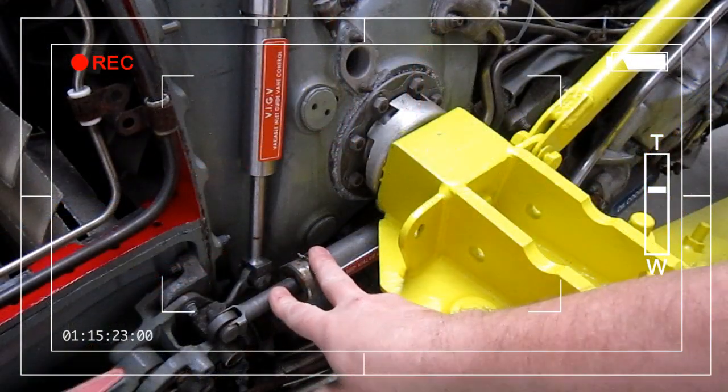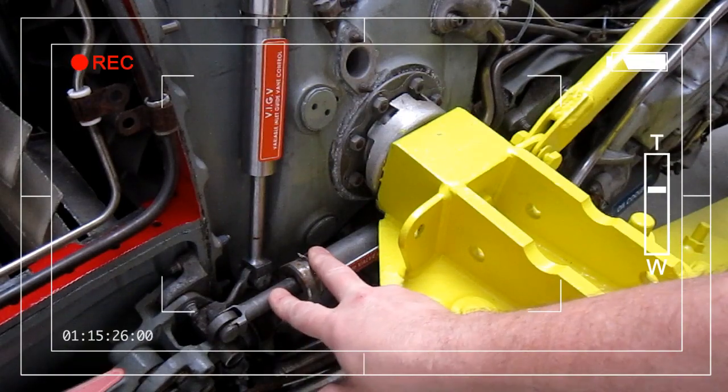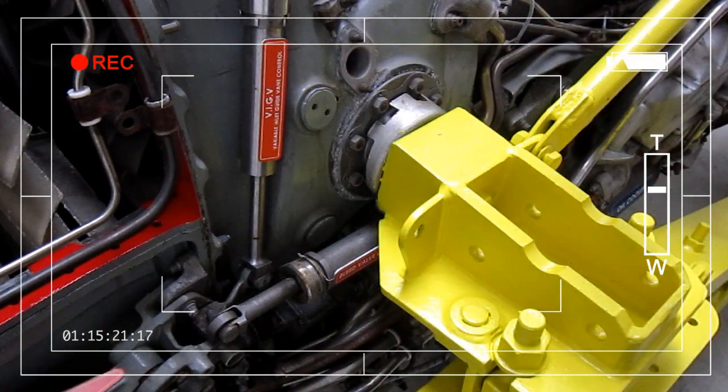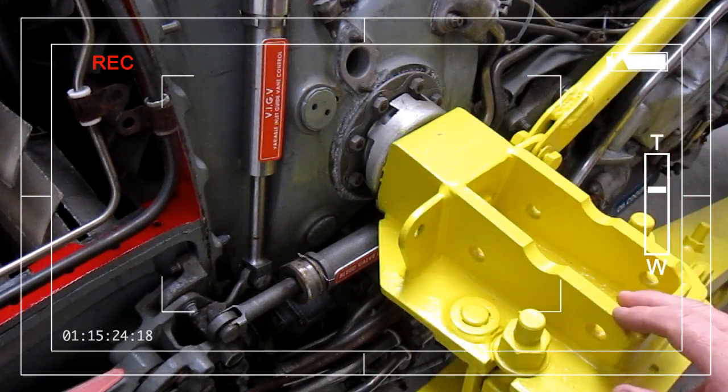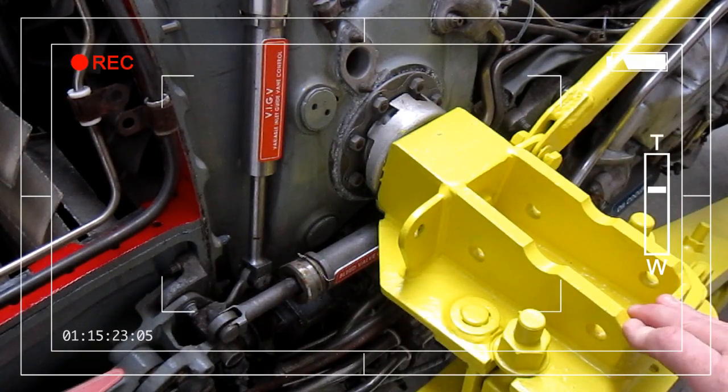When starting the engine or at low RPMs, there's going to be reduced back pressure in the combustion chamber. As a result of that reduced back pressure, axial flow of air through the engine will increase, causing an imbalance between axial air flow and RPM. By bleeding air off at low RPMs we avoid that undesirable scenario.